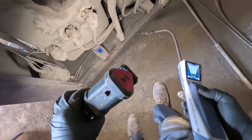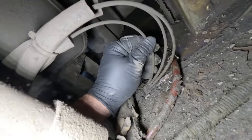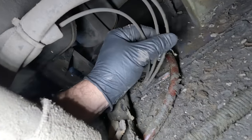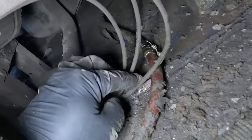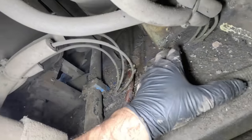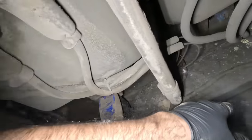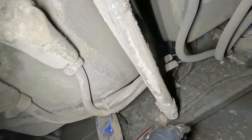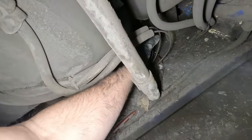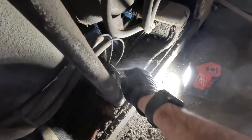We're getting something here — it's going to be in those damn capillary tubes. Look — I see something wiggling right here on that gold-looking piece. There you go. Yep, it must be this one right here. That's it. Now why in the world did they run that on there like that? You know it's gonna vibrate. Oh my gosh — look at that. I wiggled it so now it's leaking like a beehive. We're leaking oil like crazy now. So we know it's right there.